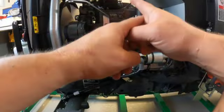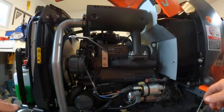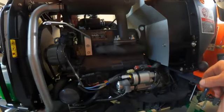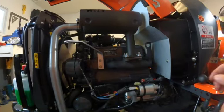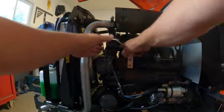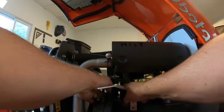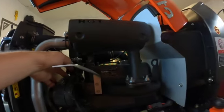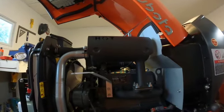The issue is if anybody was to put a cab on these — now why you'd put a cab with heat on these, hey, to each their own. Some people would put their heater lines into the thermostat bypass. And when you shut your heater off, the thermostat bypass wouldn't be active anymore, which would be problematic. So they actually do sell a little spacer that goes between the thermostat and the engine block front cover — it has an outlet — and you can just plumb the heater return into that. Works really, really well.